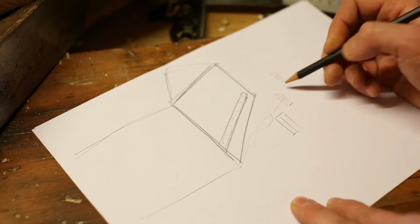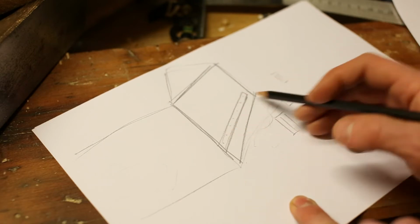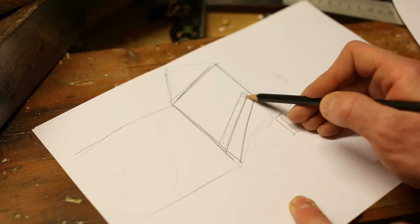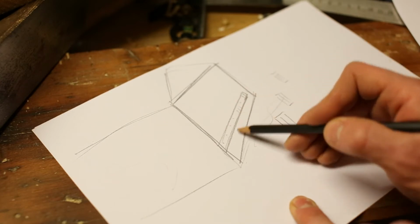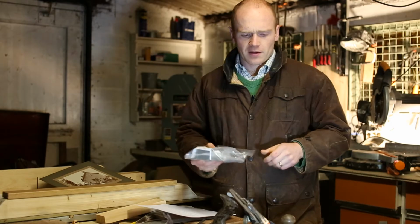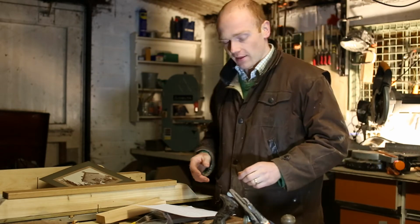It's a 4-foot shed, so we'll do some posts down that side. And I bought some mini joist hangers, so we'll probably run just a couple of 4x2s across, because actually the shed has got a strong base anyway, so that'll sit on both the posts and the wall plate. So that's probably more than a one-man job, but I'm going to try my best and get that done.